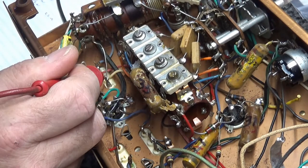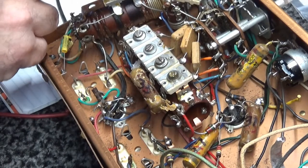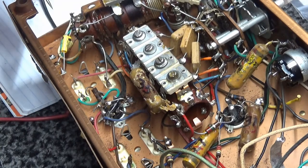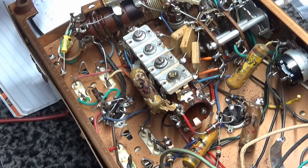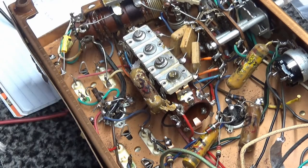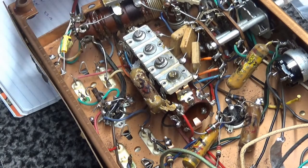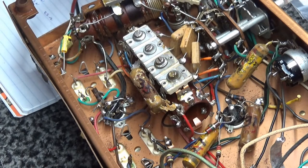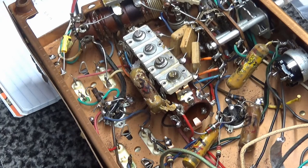Alright, this is coming off the transformer, coming on the white wire coming over here to the switch. I don't remember what that switch is. No, I don't have my case. Let's see. Let me get the schematic. I've got to figure out what part of the circuit this is in. C21, right? Let's find C21. C21 is a 0.01 microfarad going to pin 3.